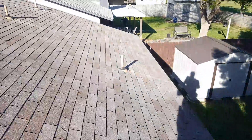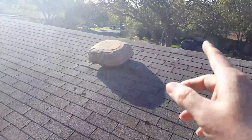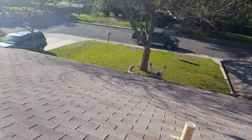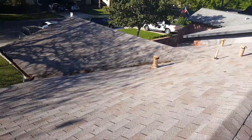You'll see that on that side, and then also the same thing on this side. Most of this siding has some damage to it and should be taken care of. Those nail heads are in various places all throughout the roof, and you just want to cover those up so that the nail does not rust and come loose and allow water to get in.